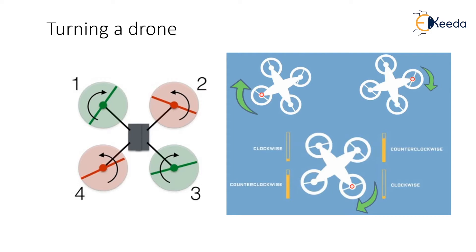If there is no torque on the system — the system here being the drone — then the total angular momentum just remains constant, 0 in this case. I will say the red counterclockwise rotors have a positive angular momentum and the green clockwise rotors have a negative angular momentum. I will assign each rotor a value of plus 2, plus 2, minus 2, minus 2, which adds up to 0. Let's say you want to rotate the drone to the right. Suppose I decrease the angular velocity of rotor 1 such that now it has an angular momentum of minus 1 instead of minus 2. If nothing else changed, the total angular momentum of the drone would now be plus 1. The drone then rotates clockwise so that the body of the drone has an angular momentum of minus 1.